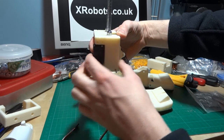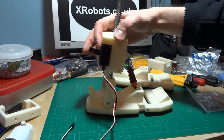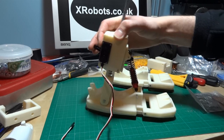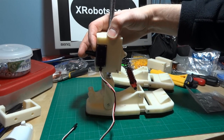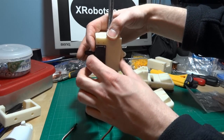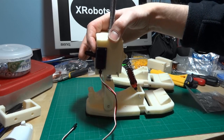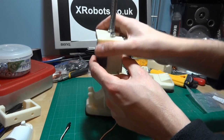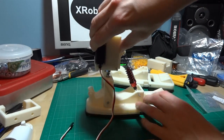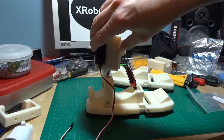But as it loosens on here, the only way the leg can lean forward is by compressing the shock absorber. So basically we're looking at something that's quite compliant with stretchy tendons, and hopefully also active with a gyroscope that's going to sit in here, which will bias the servo in either direction depending on what the motion of the shin is.